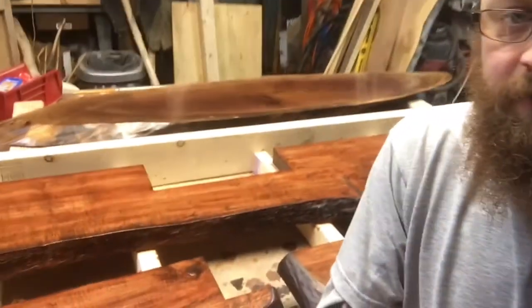After routing flat, I belt-sanded and used my five-inch disc sander. Then I moved on to some finishing work — putting down a pre-stain and applying about three coats of red oak stain. Maple is tough to stain; it doesn't really accept stain as well as some other woods, so there was a little difficulty there. After the stain dried I went over them with quad-zero steel wool to rough them up lightly, then started the clear coat using a wipe-on satin polyurethane.